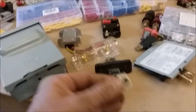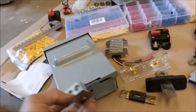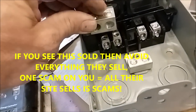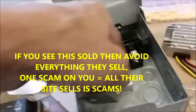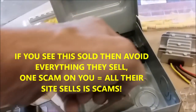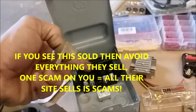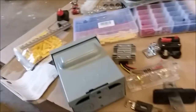Be aware: if you use aluminum wire it has to be the correct heavy gauge — not that thin stuff. That AC breaker is only 30 amps per side because of how 220/240-volt AC phasing works. Don't use it, don't burn your house down.